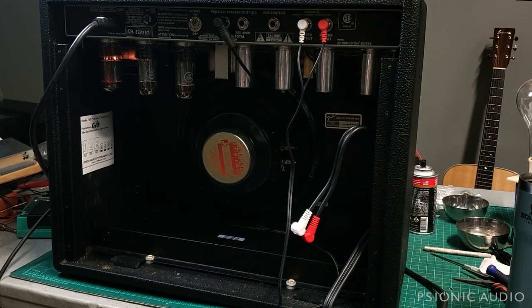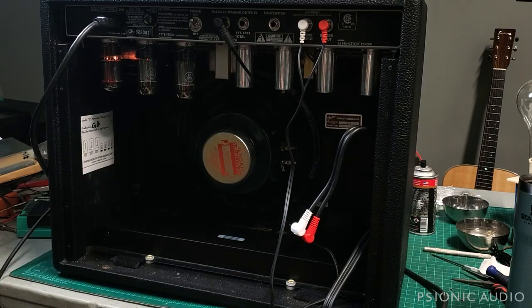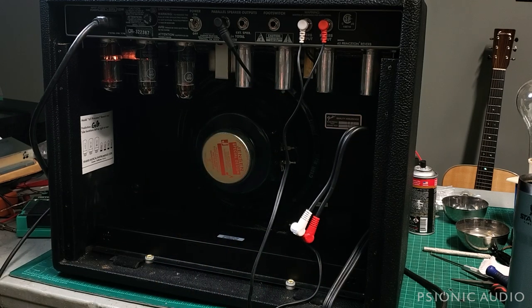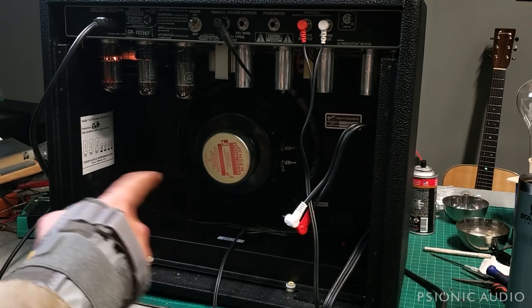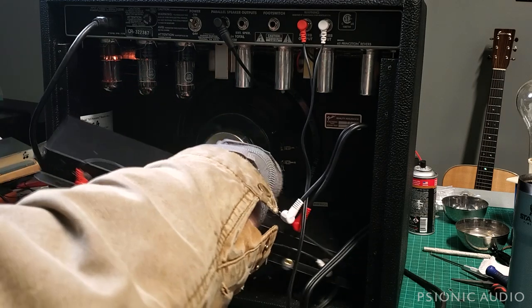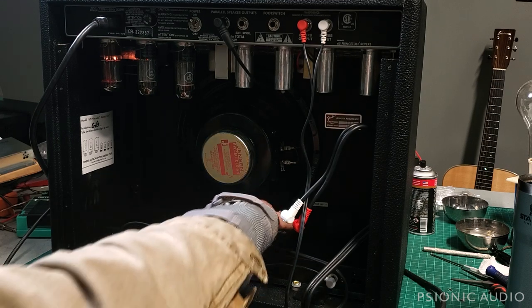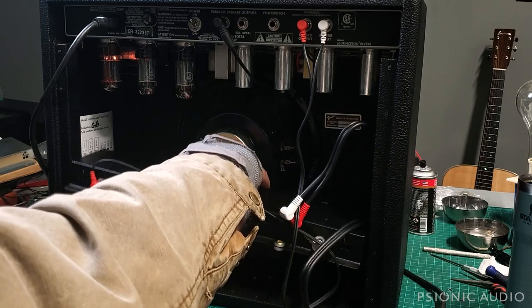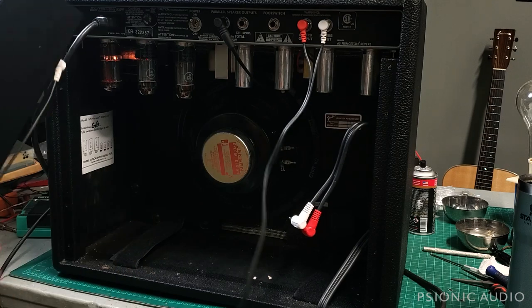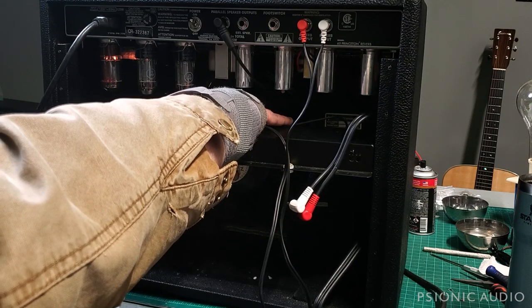There's one other thing I need to check. Last night when I was doing initial tests on this, I thought I had hum with the stock cables, but I just realized that I've got the red and white reversed, and that might have to do with shielding — if there's a break in the shield on one of these. Let me flip those and confirm that that's still good. Now that's fine. We flip this tank around 180 degrees, like it was when it came in, and even this Mojotone tank might be noisier this way. Yeah, it's noisier that direction — it's harder to hear because it's not as blatant. Moving it closer to the transformers in this direction versus the proper direction rejects noise much, much better.